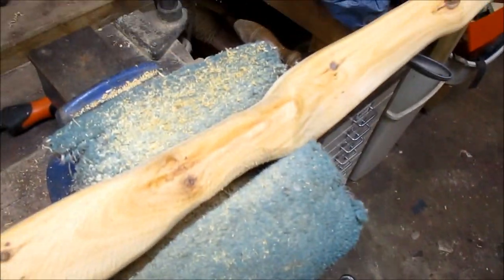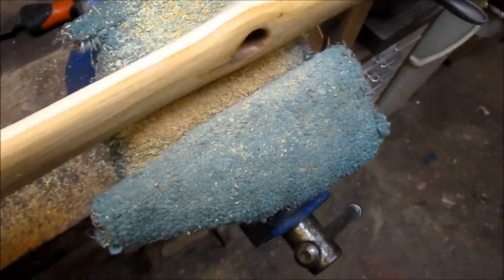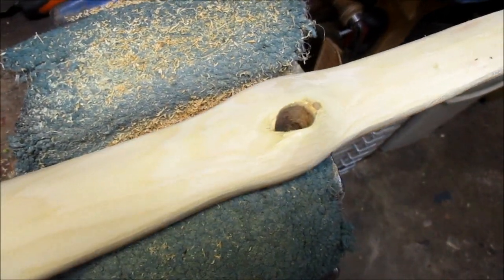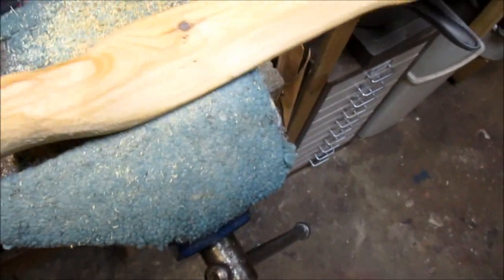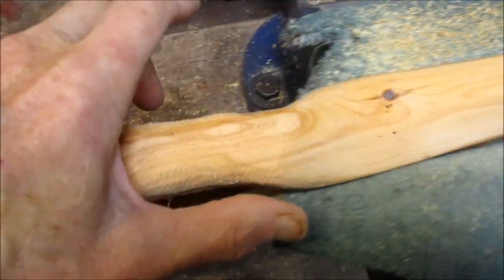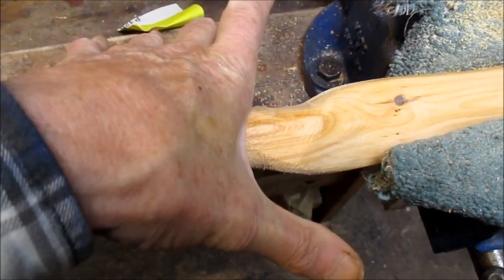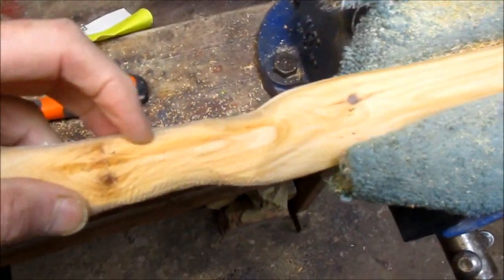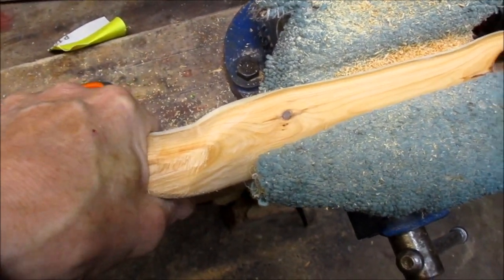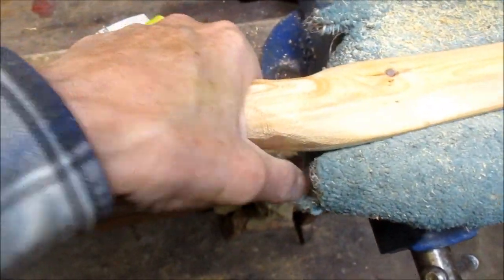I've had it to 45 pounds at 24 inches. I've started cleaning up tool marks, checking the thickness, looking for the thick spots as I run my fingers and verniers over it. I've started shaping in the grip a little bit more — that will be the arrow pass; my thumb will sit under there. I'll nestle my hand onto it and anywhere I can feel it touching the hand, I'll just rasp it away until it fits comfortably with no pressure points.